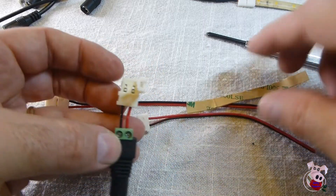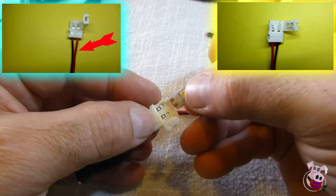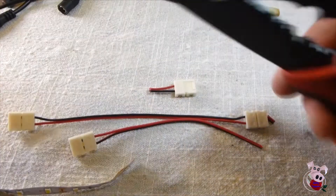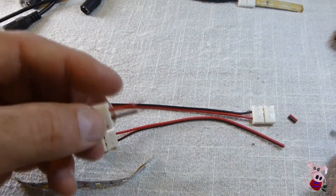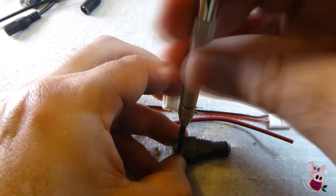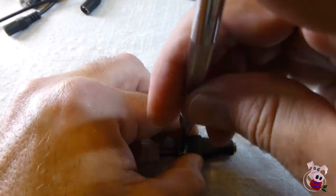Note that the extension at one end will connect with the red on the left, and on the other end with the red on the right — all that means is you flip your LED strip to align with whichever end you're using. We're going to cut it a little shorter than half so when it sticks into the house it doesn't hit anything, but leave it long enough to strip the wires and get them into the barrel connector. Strip about 3/16ths of an inch, stick it in the barrel connector — red goes to positive, black to negative — and make sure you loosen those screws so the connectors go right in.